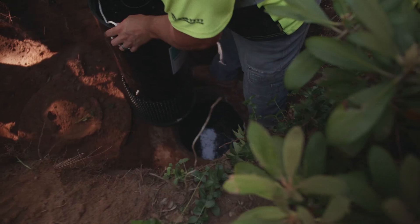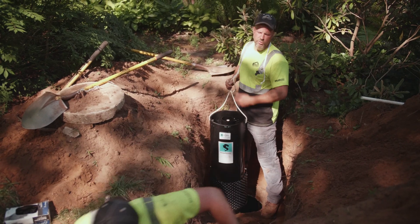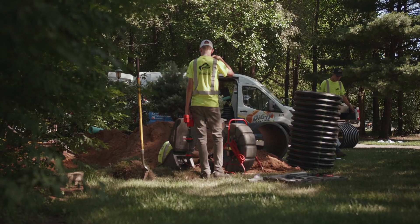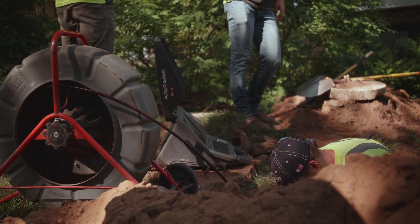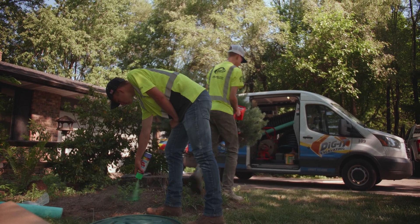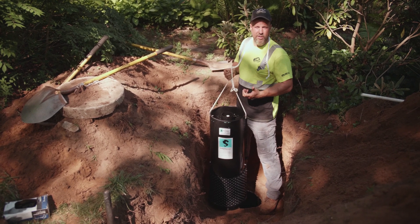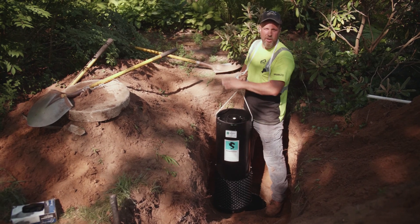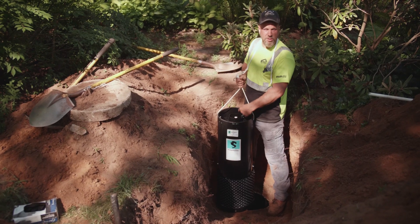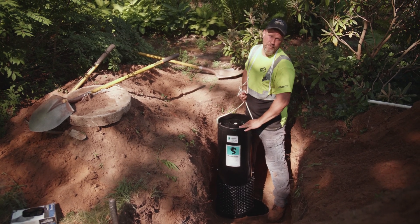What happens is as this air is being circulated, it constantly circulates all of the liquid inside the septic tank and keeps turning it over, processing it, and adding oxygen to it. So it's keeping your septic tank in an aerobic state and it keeps the bacteria very active and very aggressive, and it cleans the water very well. You have an air pump that has a line here and what that's doing is it's constantly supplying air into the tank and it's being diffused through the unit.